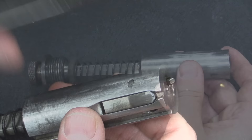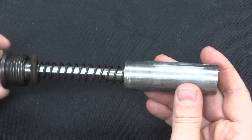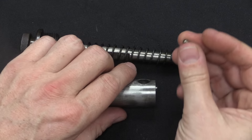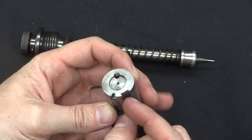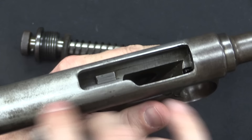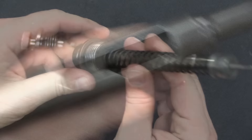The same thing goes for the spring — it's got one spring that functions as both the main recoil spring and also the striker spring. So the total number of parts in this is something like 17. You compare this to some of the other really complicated, difficult-to-make pistols on the market in the 1890s, and it's remarkably simple and efficient. One other thing to point out is a little tiny pin — this is the ejector. It's a floating ejector and it sits in the bolt. When it goes all the way forward, it punches the case out. Normally it sits flush with the breech face. When the bolt cycles backwards, this track runs over that lug, and that lug hits the ejector, pushes it forward, and causes the case to jump out at the appropriate point in the bolt's travel.